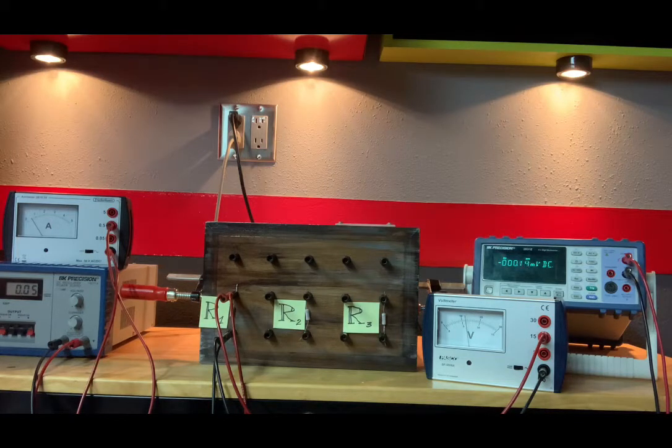Now, I'm getting 110, which is 6.0 divided by 0.053. And the reason I'm getting 110 is because we have to adhere to the significant figures that we're working with, right? The volts only has two significant figures, so how can I report my answer in resistance with three significant figures? So I know it looks a little weird if you put down 110, but I really can't claim I know what that third digit is.